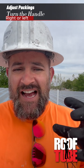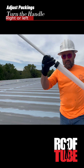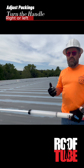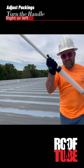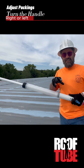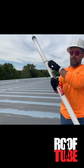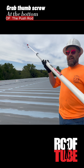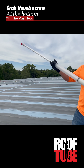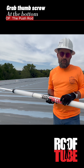The second thing is to actually tighten down our packing set. In a lot of cases you can do that right here by turning the handle to the right. Say you're using the tube and it feels slow or it's not coming out — give this like a little half turn to the left. What you're doing is you're loosening these packings. If you're not feeling the packings grip and get tight, go back to your pail, expel the material, push the packings all the way down. Grab that thumb screw with your index finger and then turn this handle to the right until you feel it grab. That tight packing set will keep the material in the tube a little bit more controllable.